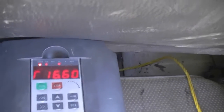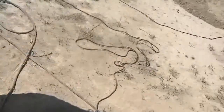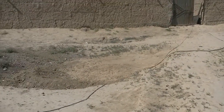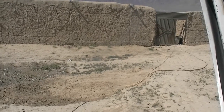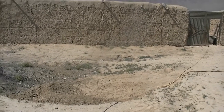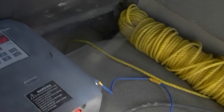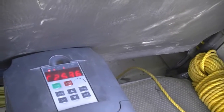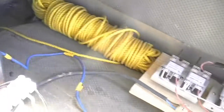Here we have the dump load — the circuit calculates when the voltage gets too high for the VFD and it clamps the voltage so that the VFD doesn't go into error. This is our control circuit with two MSP430 chips, one controlling the dump load and the other controlling the VFD, both taking a voltage sample measurement from the DC bus. Here we have a Chinese 4 kilowatt VFD with 220 volt three phase input and 220 volt three phase output.